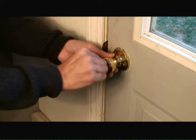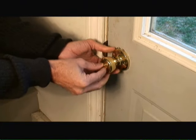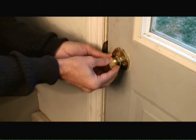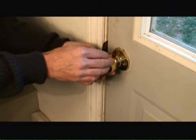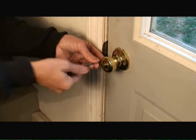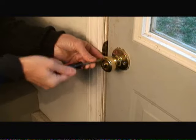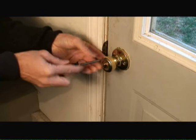If you find it difficult to twist the button to the lock position or unlock position on the doorknob, what we need to do is remove the doorknob and lubricate the mechanical moving parts inside the doorknob itself. I'm using a Phillips screwdriver to remove the screws off the back of the doorknob to get to the moving parts.